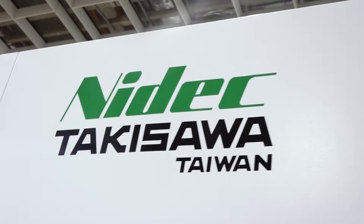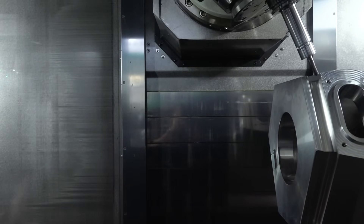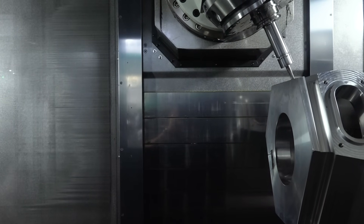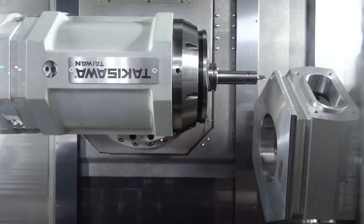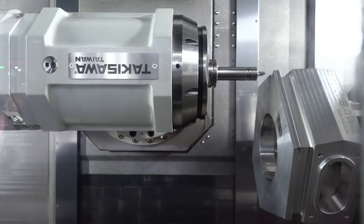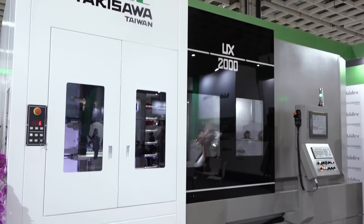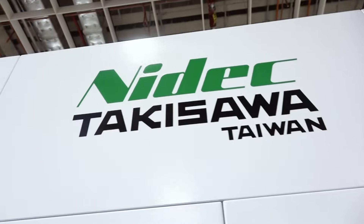The accuracy of this machine from the main spindle to the sub-spindle — I won't give away the secret, but it's a very tight tolerance. When you switch from the main to the sub, that's how you do the second op. Plus we have milling directly on the machine. Back in the old days you might need three machining centers for different kinds of jobs. Holding the front side and the back side with only one spindle is very hard — but with three spindles, and in the future four, life is so much easier.